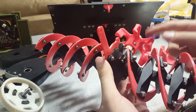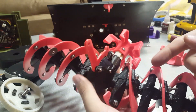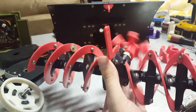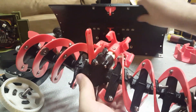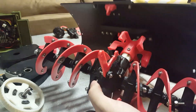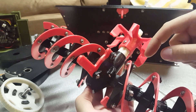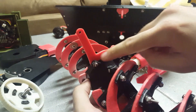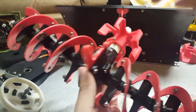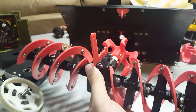It worked with the stock differential, of course, but it needed some improvement. Nothing actually changes on the snowblower body itself — only about three or four pieces changed: this mounting stick has a new shape, these two parts changed, and the white drive shaft is different. Everything else is the exact same. So here I'll install it in the blower. I got the snowblower back together with the new transmission in here, and I actually went ahead and switched back to the six-bladed impeller that has the flat side on the back, just because my other snowblower has that impeller on it, so I wanted them to be the exact same for the test at the end of the video.